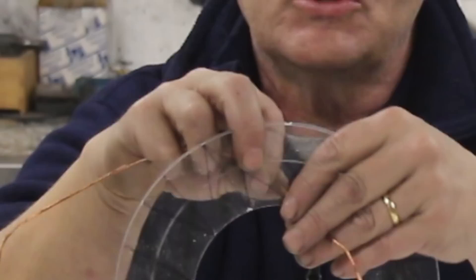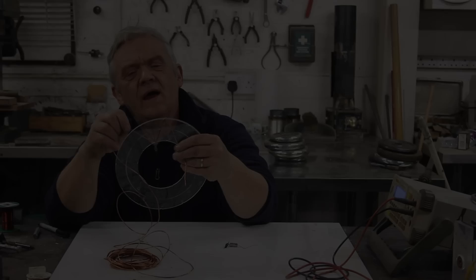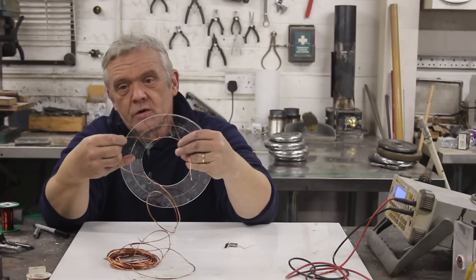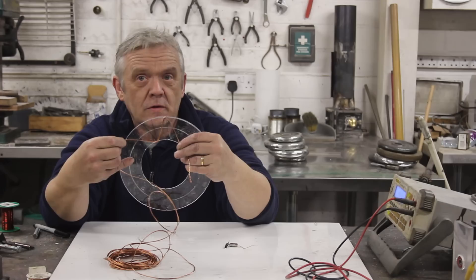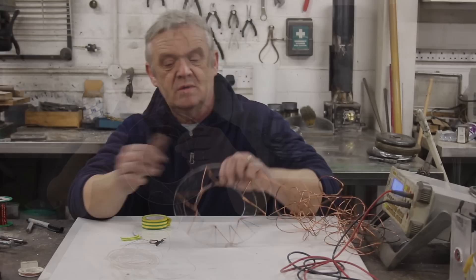To wind the coil, we start at the first notch, go up to the second notch, and then come down to the next notch — progressing around to make the triangular zigzag pattern. We go round again, this time placing each wire next to the previous one in the notch. The first notch helps you get everything lined up, and then every wire follows every other wire. I've put the wire around a bobbin to help feed it through the central hole.